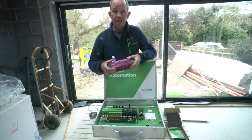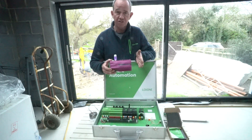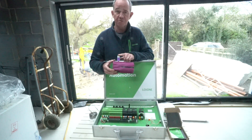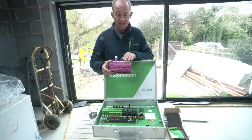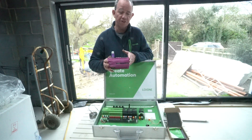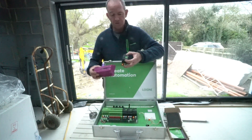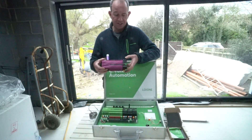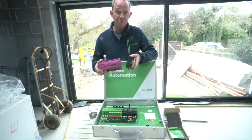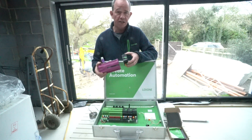I'm going to be doing whole house audio with Loxone. This is the Loxone audio server — it can work with Spotify, Apple Airplay, connect a local library via USB, and has digital input with SPDIF. The basic module has four outputs, so I can do two stereo zones from that initial box. I can expand that with additional stereo expansion units, giving either another two rooms in mono or another stereo room. I'm planning to have three rooms in stereo and three, maybe four rooms with mono speakers.